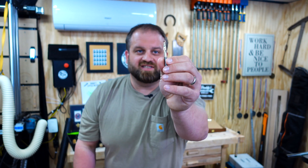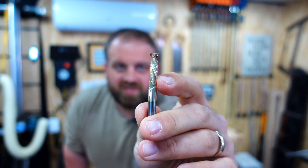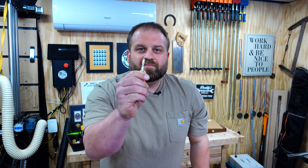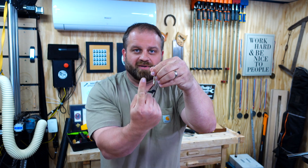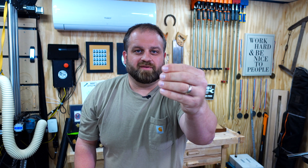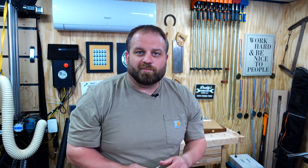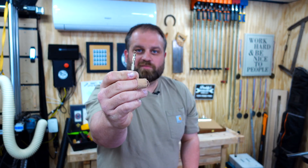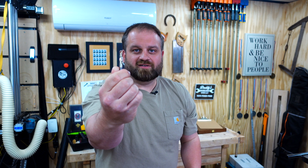The next bit is the spiral end mill. You can see here as I turn it, it's a spiral. This is also a compression bit — you can see there are two cutters on every single flute. These come in up spirals and down spirals, meaning the direction you're pushing the material. If you're doing a pocket, you want an up spiral so the bit pulls material up towards your dust collector. The spiral shape is perfect for any hardwood operation and reduces chatter and vibration. You can use the spiral end mill to make intricate shapes and perfect pockets. This cutter is so versatile — this should be the second bit you buy. It works on wood, aluminum, or plastic and comes in multiple diameters: quarter inch, eighth inch, sixteenth of an inch — though they start to get delicate and it's easy to snap a bit. I like the quarter inch because even though it wastes a little material, it's a really sturdy bit.